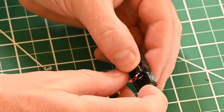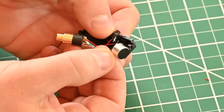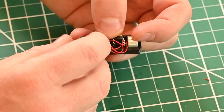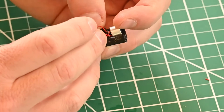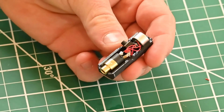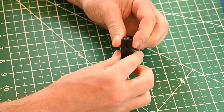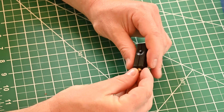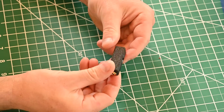Let's get it packaged up. I'm going to put these wires up towards where the microphone will go, and then this microphone will go in here. Here's where the Electret goes. I'm going to hold both of those in place, and then this guy comes down here. All of that remaining wire gets carefully tucked up into the body. And if nothing shorts — which I don't think it will — I should just be able to take the top cover and place that on like so. It's just a tight fit. No magic to it, just a nice tight case. I'm going to take that and screw it on the bottom.